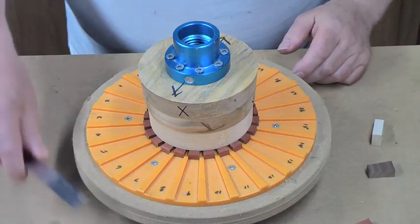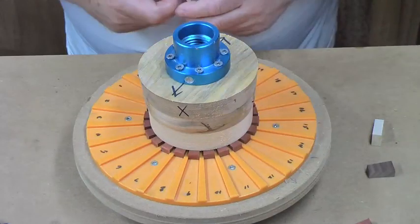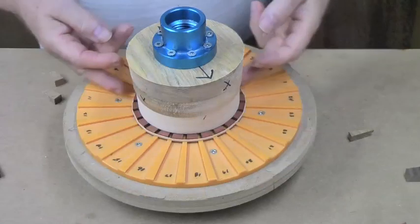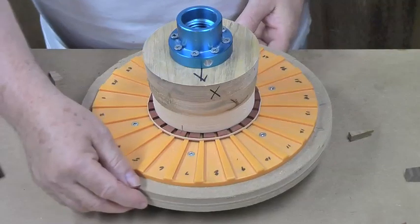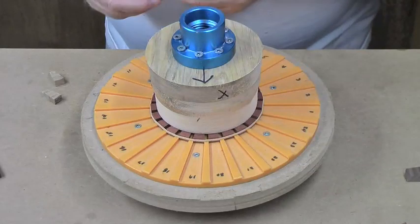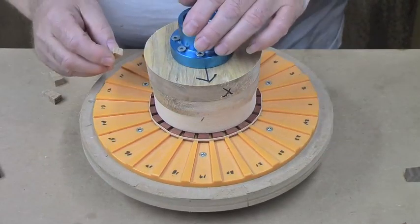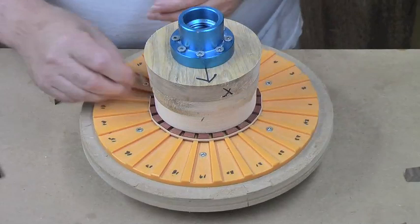The next thing I'll do is I'll draw a line around here, I'll put a rubber band around the bloodwood and put this back in place, and put little blocks here to hold it while the glue sets. I put a rubber band around the bloodwood, re-centered this — I have an alignment mark right here so I know that's exactly where I took it off. Next we're going to take these little tiny blocks — these are oak — we're going to put a little hot melt glue out here and stick them to the side. You can use three or four, but you have to watch you don't get the glue too close to the maple, or you'll actually glue this fast and when you're going to take it off it will already be stuck together, so we have to keep the glue out here a little ways.